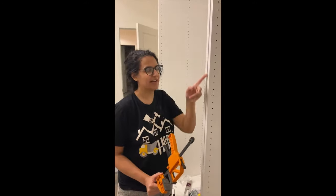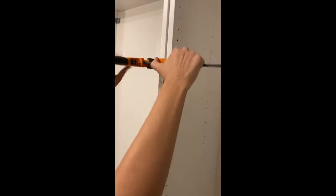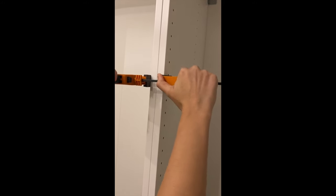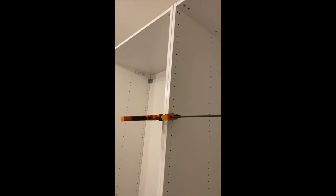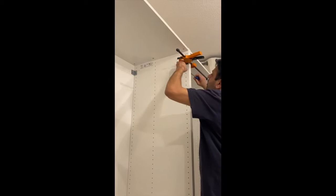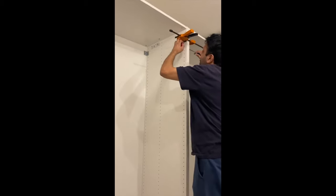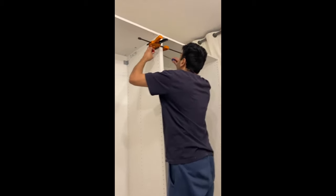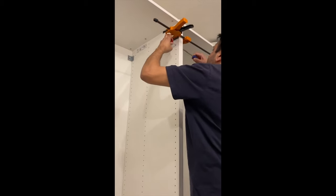Your PAX organizers will most likely have a gap between them, which is why it's important to push them together. They come with screws to attach the units — one at the top and one at the bottom — and they'll be totally flush. Installing these turned out to be more of a challenge than I expected, but we got them anchored really securely to the wall and were at the home stretch.